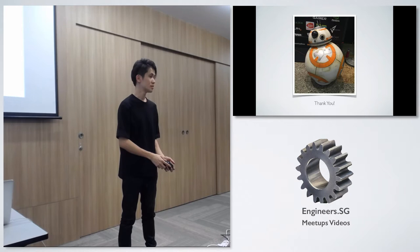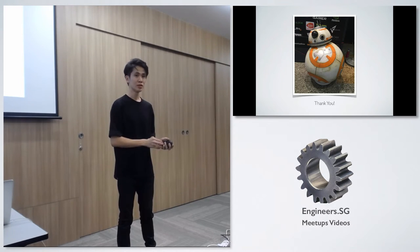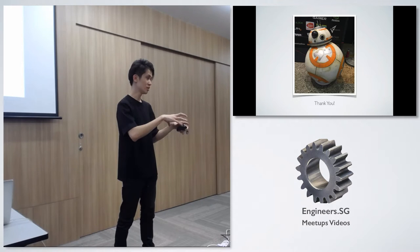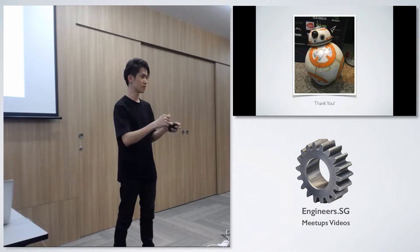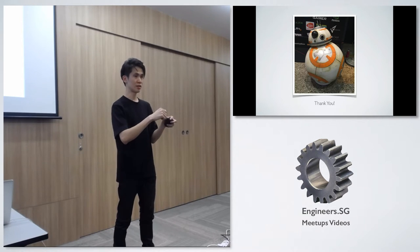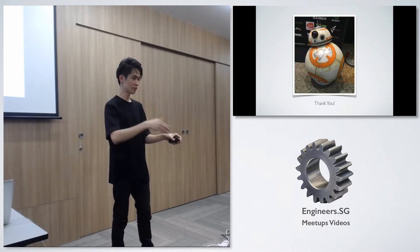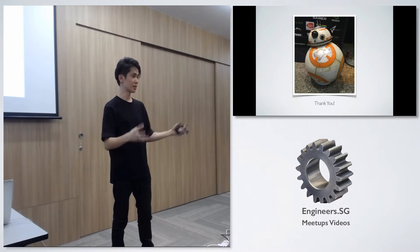Use the resin to make a duplicate? No, for the mold itself, I use a 3D printed part and then I take silicone, it's like a liquid thing, then I pour it over and when it hardens it becomes like rubber. Then after that I take plaster, it's like plaster of Paris with, they call it like a canvas thing. So I put it on the canvas and then plaster of Paris so it has the shape, like a shell thing. Then I can take it out.